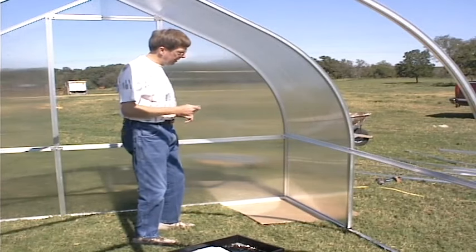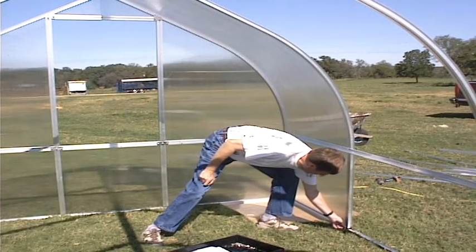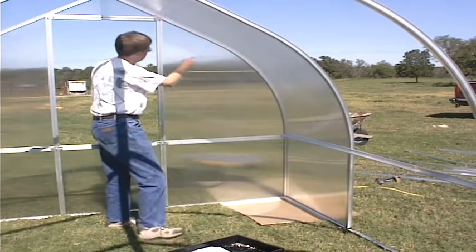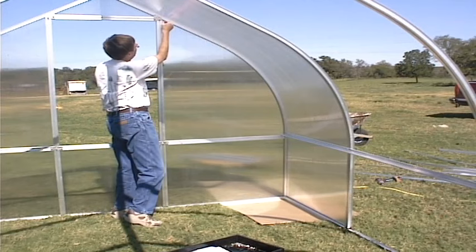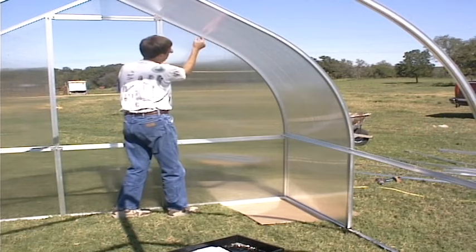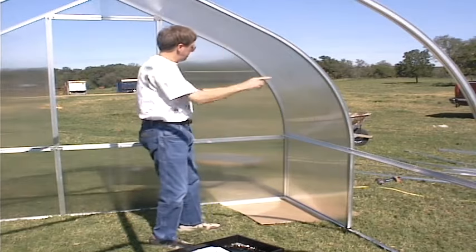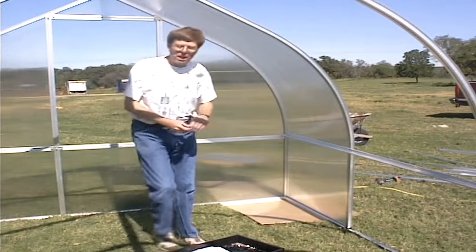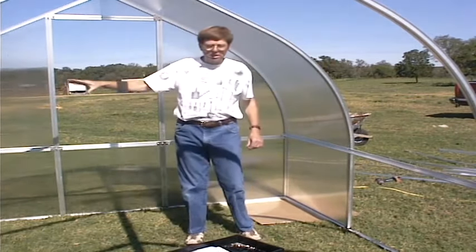You can then slide a screw in for the bottom of the profile. At the bottom, go in there and slide the screw up. And in the center, in the corner curve, you can actually slide the screw down from a little hole that's been made at the top here. So that's what we did, and we tightened this lateral support so that these two now stay in place. This way, this side can be okay. Because now, when I have done this side, one panel, we're going to the other side and do a panel.